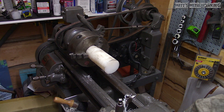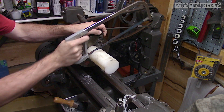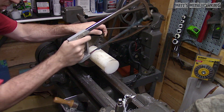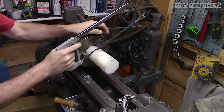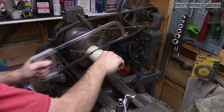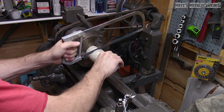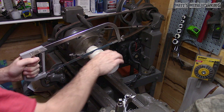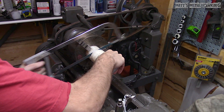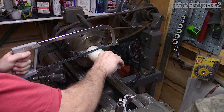The total height of the nylon insert will be 1.5 inches. This includes a dowel where the insert fits into the cup on the jack frame, and above for the pinch weld height. This is fairly specific for the jack design and my car. Unfortunately I don't have any parting bits able to go deep enough for the nylon, so I'm forced to cut this by hand. While nylon is a softer material it isn't as easy to cut as I was expecting. Switching between a coarse tooth wood saw and a hacksaw blade, there was no quick method. The wood saw gave a wider cut but the saw was binding; going in after with the hacksaw blade, which is thinner, made the cutting slightly easier.